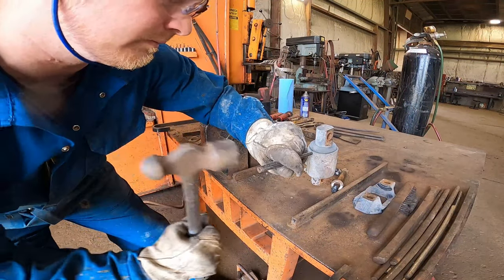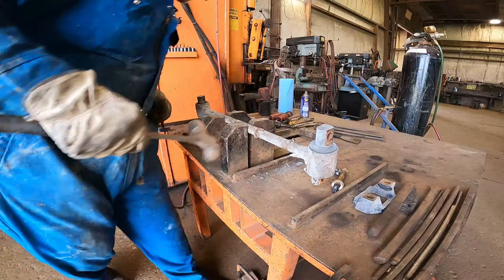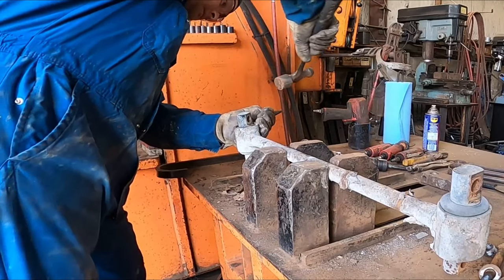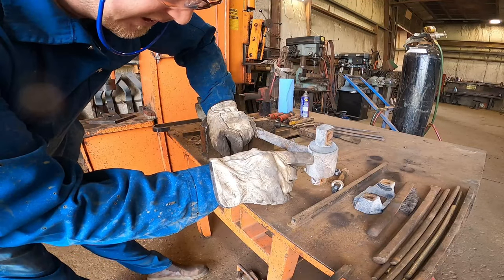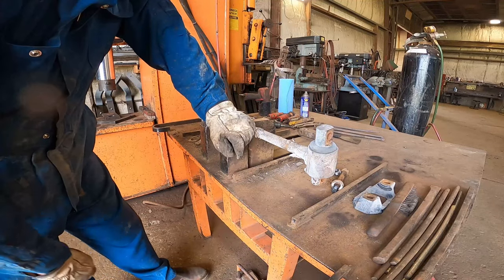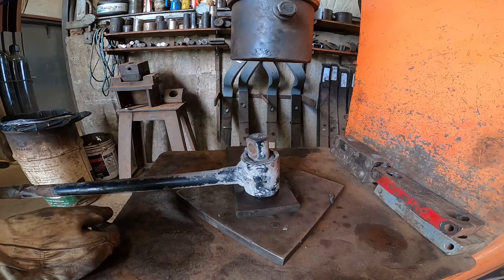So now I'll take and mark them. The reason why I use a center punch is because I can get them ridiculously accurate - I can line it right up to the very center of the punch mark. If you put a marker on there, you could be off by an eighth of an inch. So now that we have them marked, we can push them out, clean them up, and because they're already marked, I know exactly where they're going to go and we can put the new bushings in.